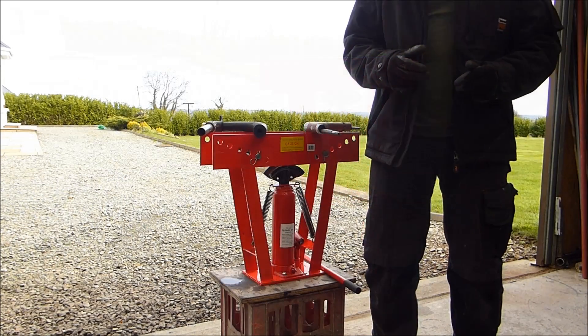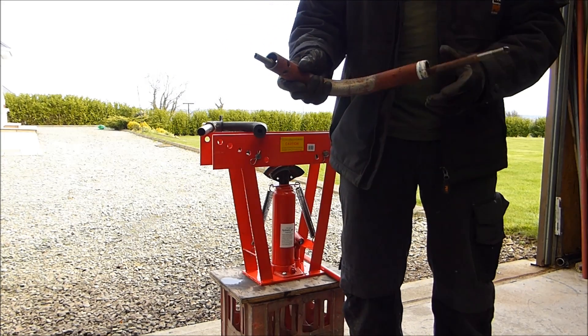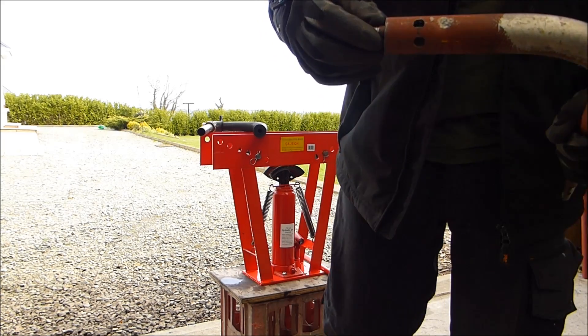Okay YouTube. I've just bent the pipe with the ice inside it. Great success, no problems with it at all. So you can see a bit more clearly now - these are the holes that I drilled in it. These are to allow air into the combustion chamber, and they're drilled at 60 degrees apart.